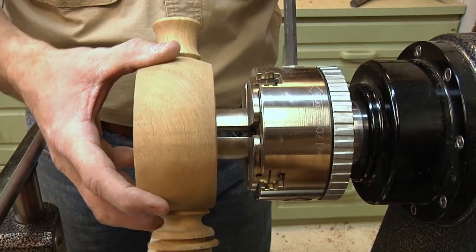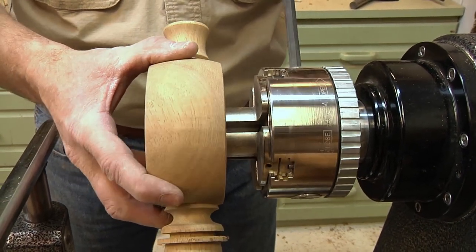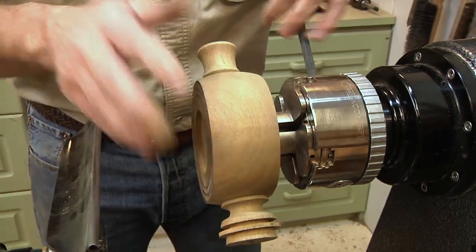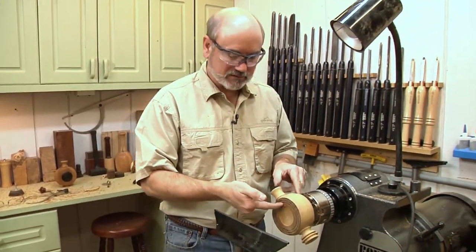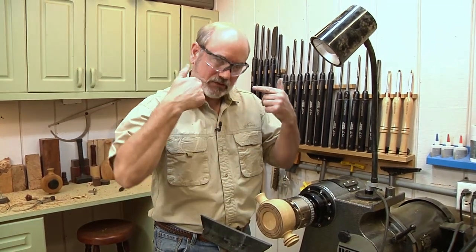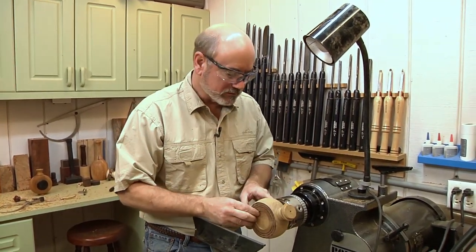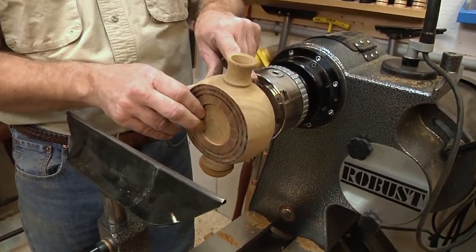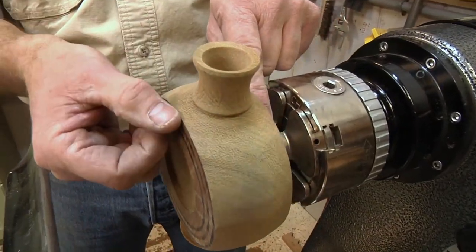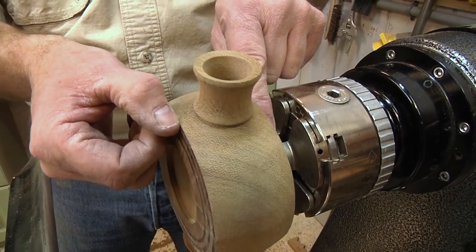We open the jaws up and wiggle it until it fits into place, and I'm going to tighten it just a bit. Holds that beautifully. All we're going to do now is turn this side just like the other side. The only critical thing is I want to look at the neck here — however much wood I have exposed over here, I want the same amount over here. So I might take off about an eighth of an inch on this side.